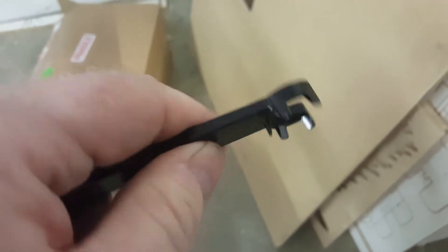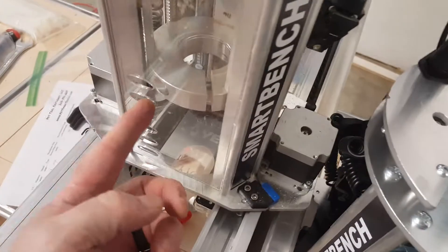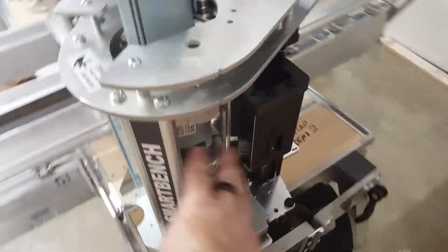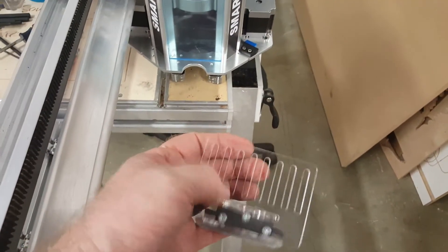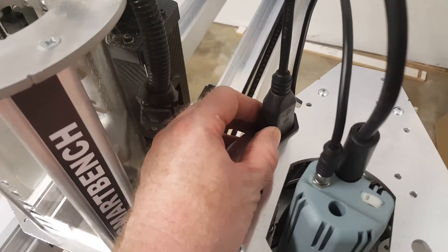Here are the two Z-heads side by side. The new one is the 1.2 Precision, made for the Yeti one-kilowatt spindle, and this is the A&B one I've had and loved. On the old one, we adjusted concentric rings for spindle changes and pulled the spindle out through the front. Now we do it through the side, and there's a lot more airflow — I think that's why they changed it, to get better evacuation out of the back dust chute. The new front dust cover also has air slots to bring more air in for better chip evacuation.